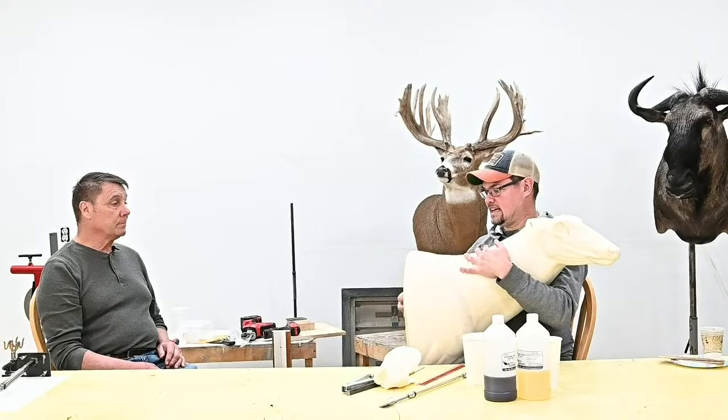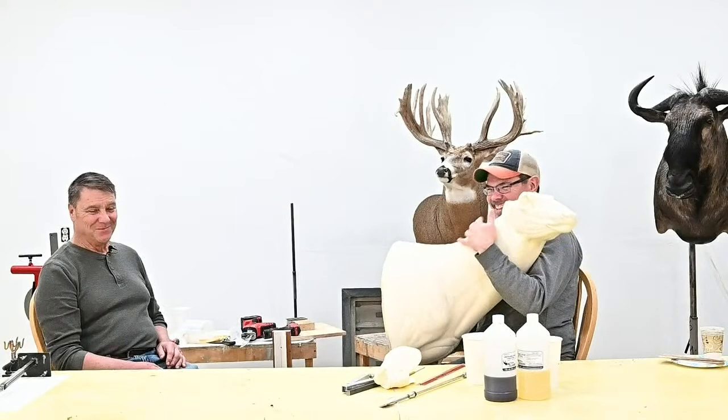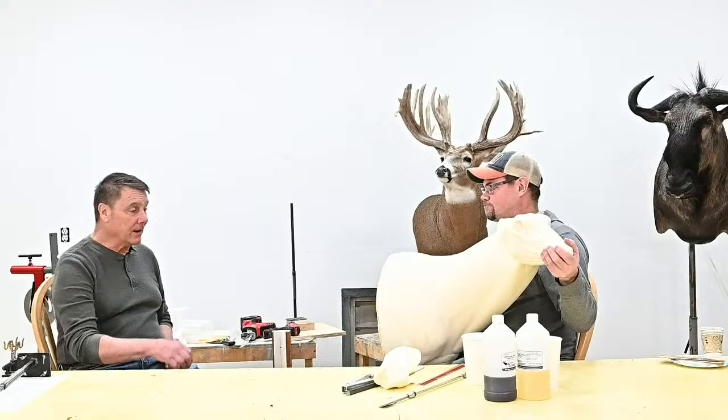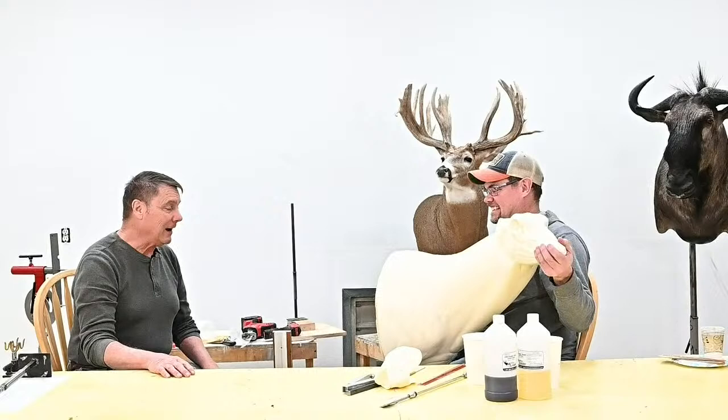But if you know you're going to do that, don't be afraid to ask your supply companies to pour you one without the backboard. Why didn't we do that? I'm not sure. We should have. I bet we just took it off the shelf. Okay. So we're going to take a Sawzall now, and we're just going to run it right along that backboard and cut the backboard out, which if we'd have told our supplier we need it without a backboard, we would have got it that way, but we didn't. So we're going to cut that off to start with.